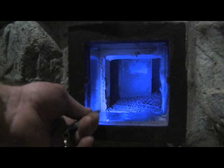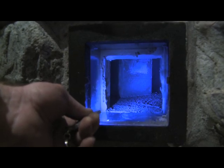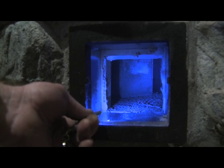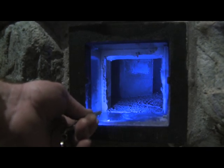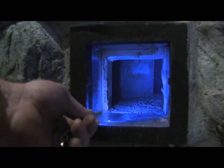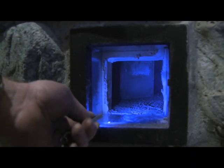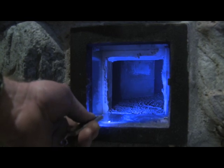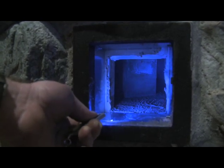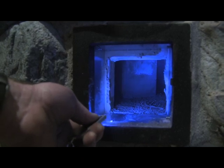Well, you're actually seeing the flue gas path. It's traveled up from the firebox into the bells that we've talked about before. It's exiting the base of those bells, and it goes back under the firebox before it enters the chimney base behind the firebox. So you're seeing the natural flow path of the gases at the base of the heater.